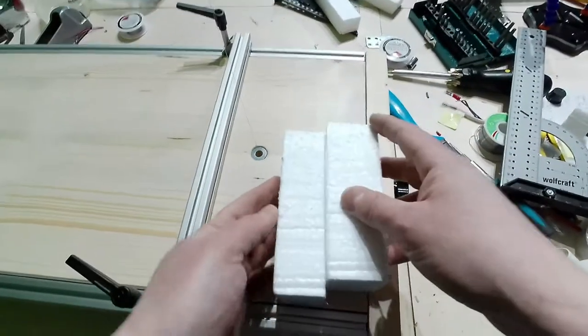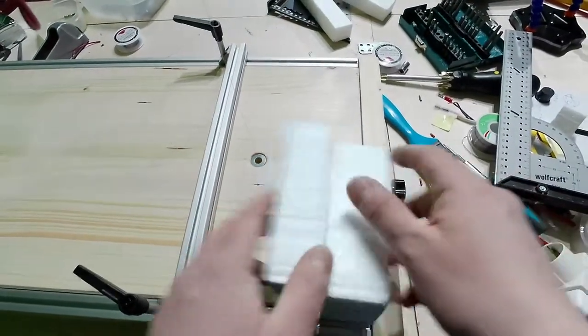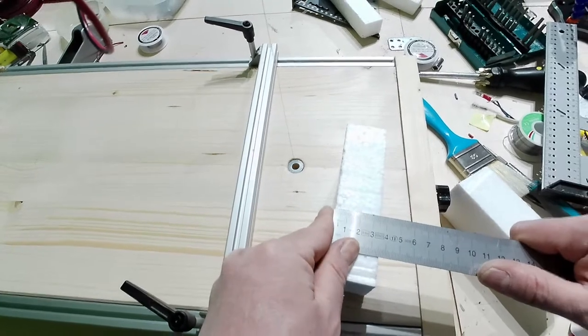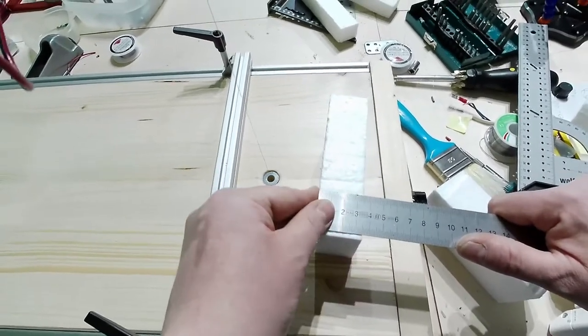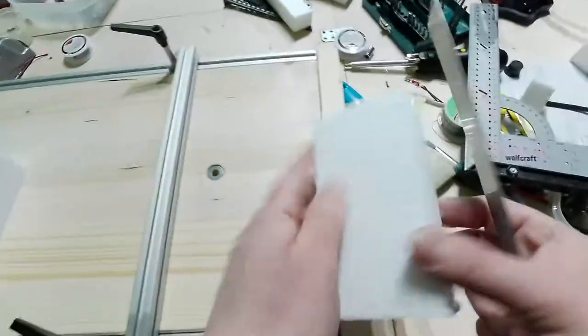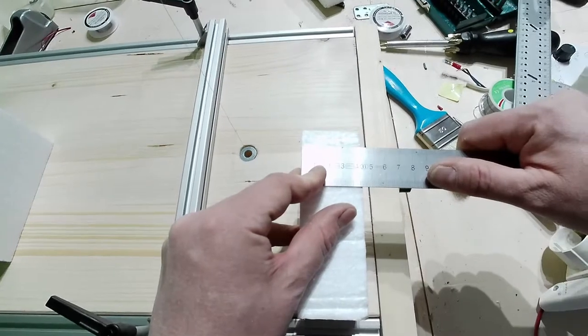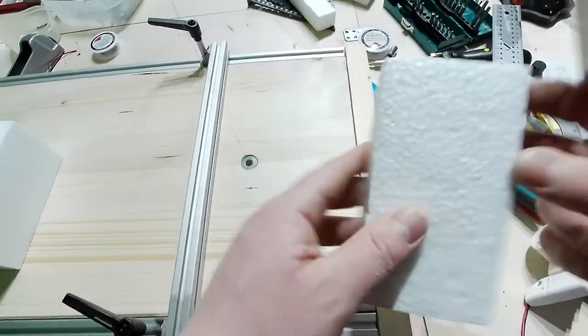Let's just measure for a moment what I've cut, because I've cut right there, through there. Okay, this was done with my previous version. You can see that it is not so smooth. Here it is very smooth. Let me just take my ruler. Here I have my ruler. And let's check here, okay? Here I have 3.4. Here I have 3.4. Here I have 3.4 millimeters. The other side, these have already been cut, so I can be sure. This is 4.3. Here I have 4, because this is not the original cut there.